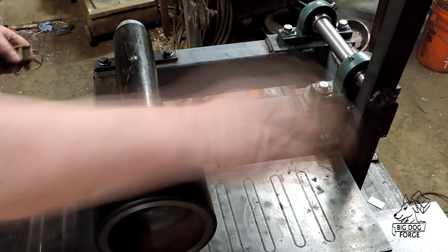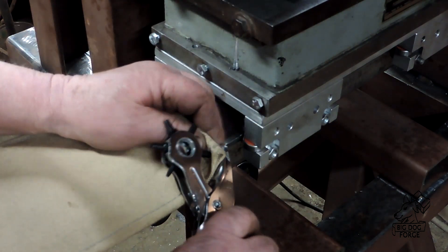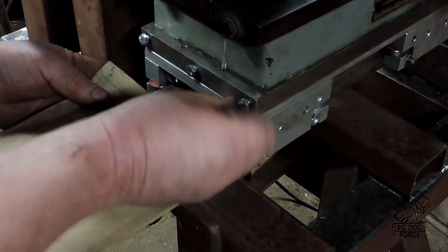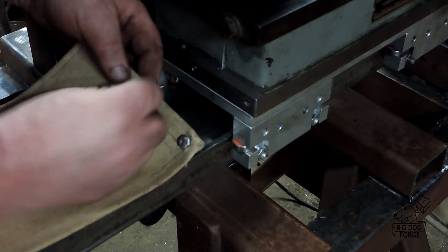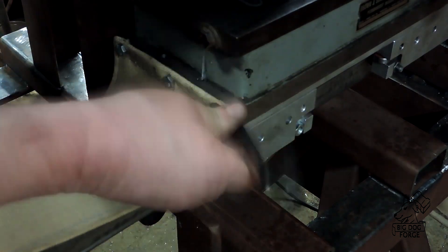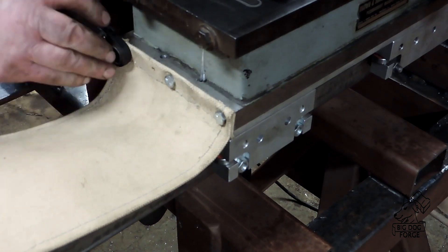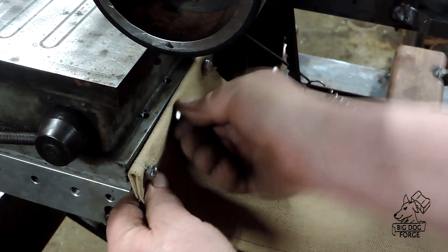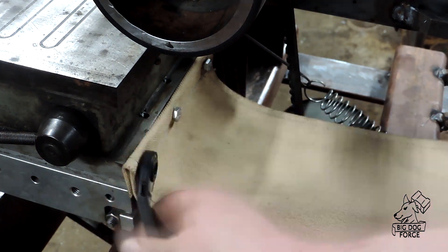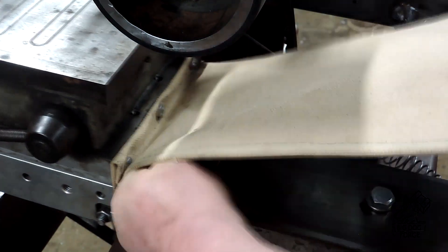We'll get those tightened down. This is some really heavy canvas that used to be a welding blanket — I've sewn it into these guards to cover up the track so we can keep grinding dust off the bearings, wheels, and tracks. This stuff is very abrasive obviously and we don't want it eating things up too quickly. These will drape over either end of the track and slide back and forth with the magnet to protect things, and as they wear out we can replace them. I sewed these up on the stitcher that I built, and at each end I sewed a little pocket so we can put some weight on the ends to keep them pulling in the right direction.